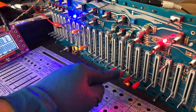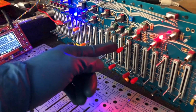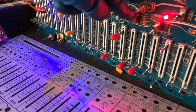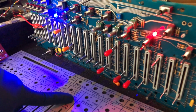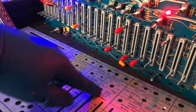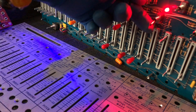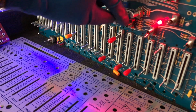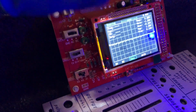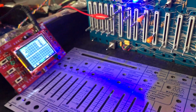Now I'm moving this, not getting any difference. From here is the switch for the sawtooth, square wave, and oh no, this one. It's this waveform, the square wave, and triangle. Here it is in triangle supposedly. Oh, here. That's my square wave, and the scope shows just some line. Even if I move this, it's the same. It's not a very good signal from the complex oscillator.